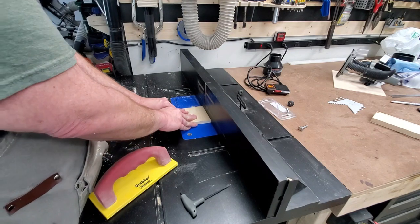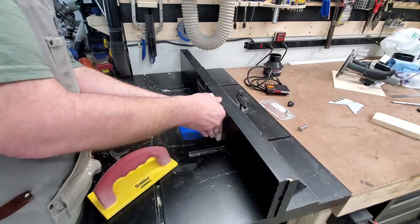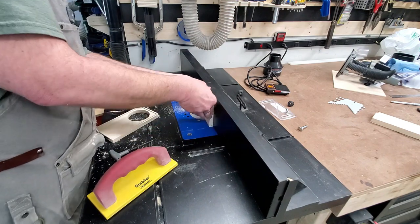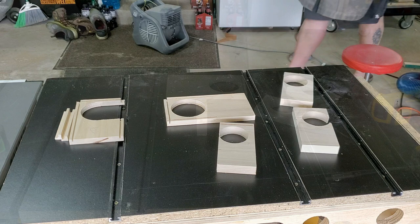I'm going to cut the corners, which are only half-inch by half-inch when done — and that's unsafe to push through the router. So I'm going to cut them out of a larger piece of stock and then finish them off on the miter saw. Here are the seven pieces that make up all the wood components of the dust shield: the corners, the top piece, the bottom piece, and the three blocks that make up the hose support block.